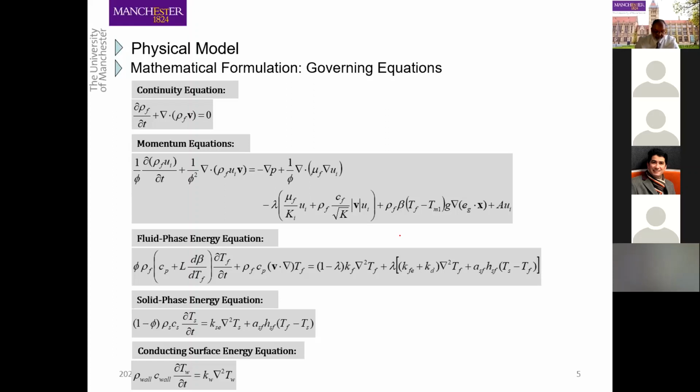That means at a certain point within the tube, there is no thermal balance between the metal foam particle and the PCM particle adjacent to it. So there is what we call interstitial heat exchange. The fluid gets some heat from the solid.